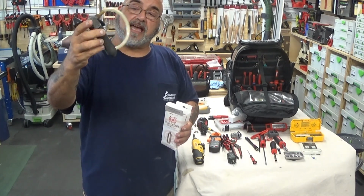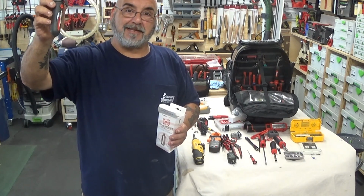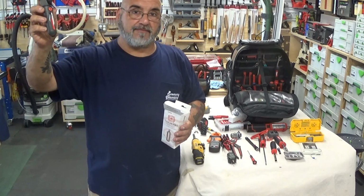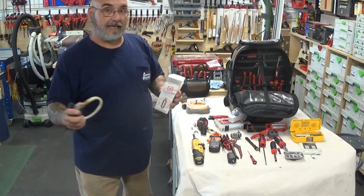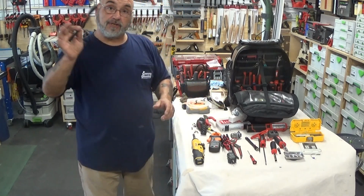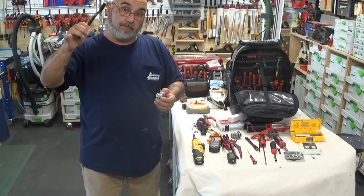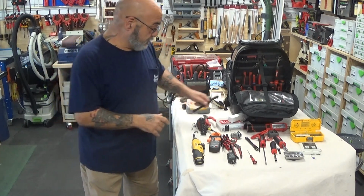You can get this in an AC store. It's drain line cleaner. It's what blows out the air conditioner drain lines. It's great for a lot of types of gas pilots and stuff like that. I use it with a wire brush for the inside of the filter and also for the burner tubes, and then blow it out with the CO2.